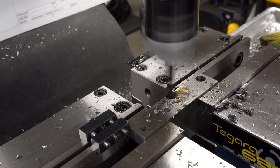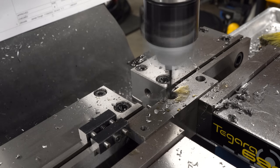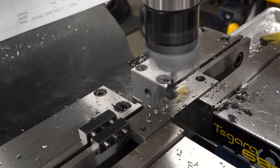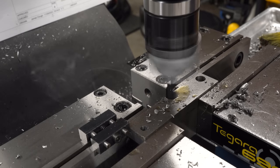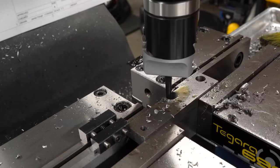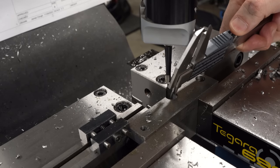I'm using the power down feed on the mill so we get a nice even consistent cut, and that's going nice and smooth - just taking a couple thou off, but it's cutting without complaint. Not seeing any artifacts near that sharp edge, so I think this is going to work. I don't want to raise the head while it's still spinning because I don't want to cut a spiral groove in the surface, so I'll rotate it out of the way and raise it straight up.